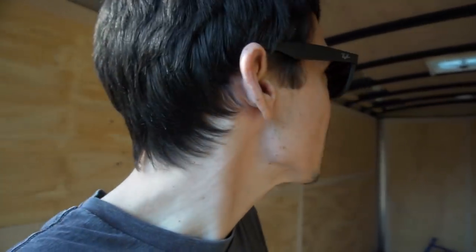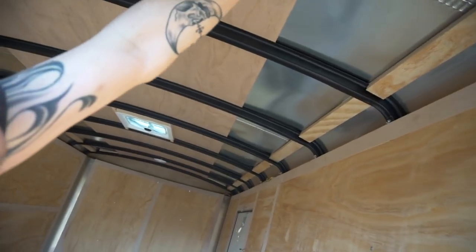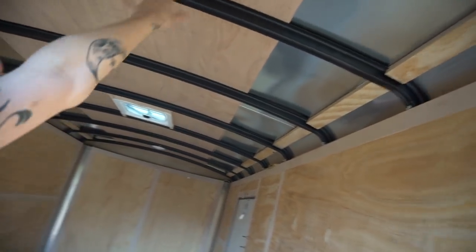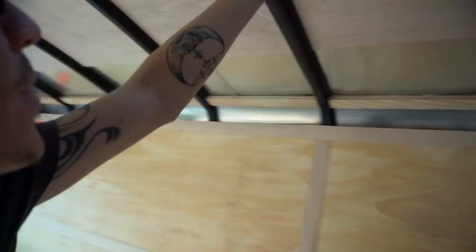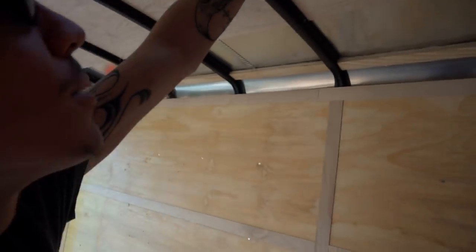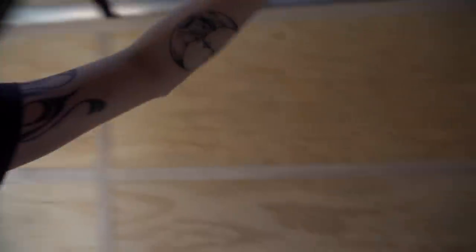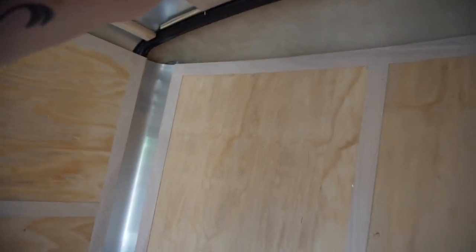There's quite a bit of work before we start building this out. We've got to pull the walls off to insulate anyway. We could leave the luan and put a vapor barrier over it to prevent moisture. We've got a leaking roof vent that'll be a problem — we actually want to put a ceiling-mounted AC unit in, and over here a bathroom with a shower, roof vent for that, and a toilet, plus storage.